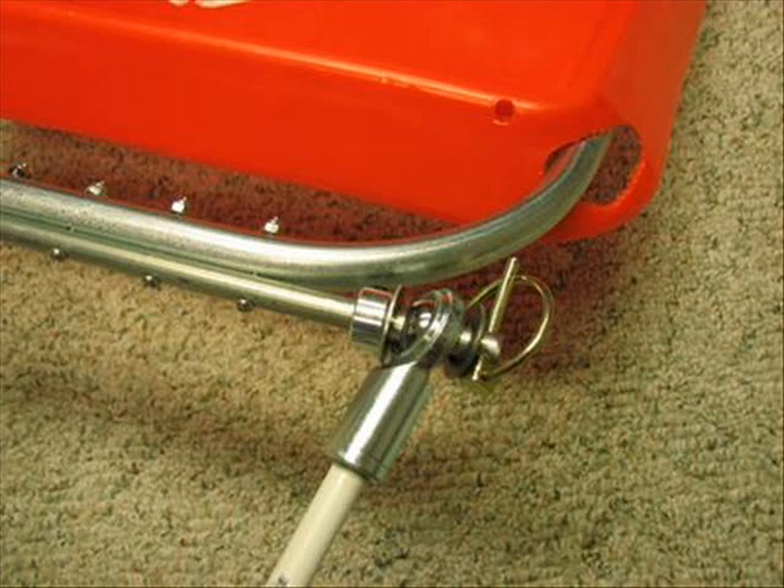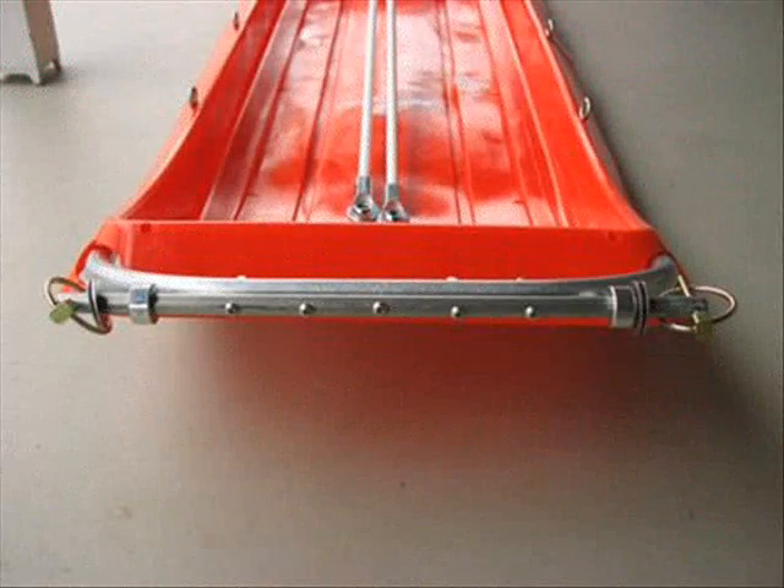The poles will be attached to the 7/16-inch rod using half-inch ball joints with female threaded ends. I went with a larger size ball joint than the rod size to allow for corrosion on the rod that I know will happen in time, so I can remove the ball joints without difficulty. On each end of the galvanized rod, I drilled a hole for the placement of a hitch pin. I also installed locking collars and stainless steel washers so the ball joints will travel on the rods where I want them.